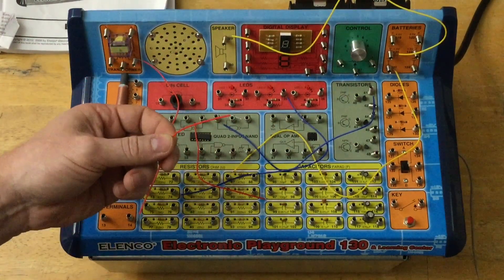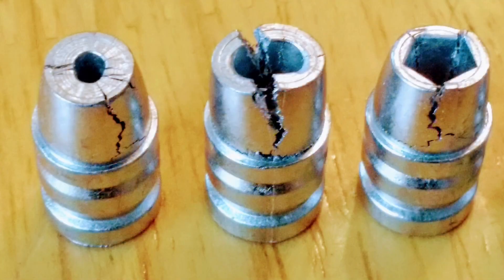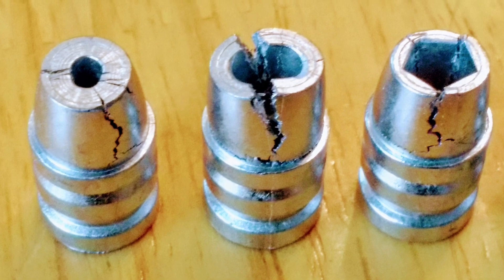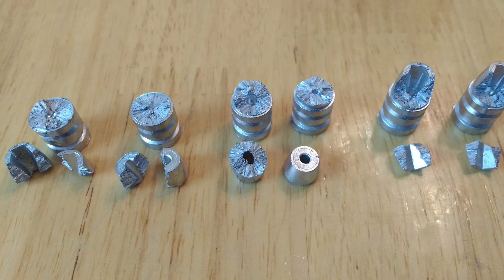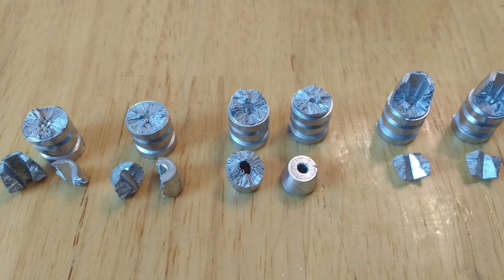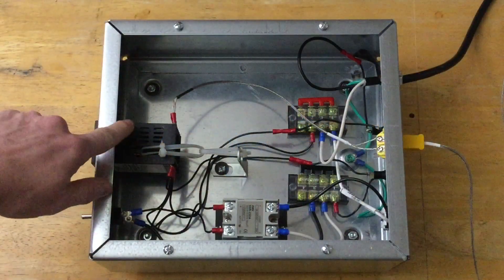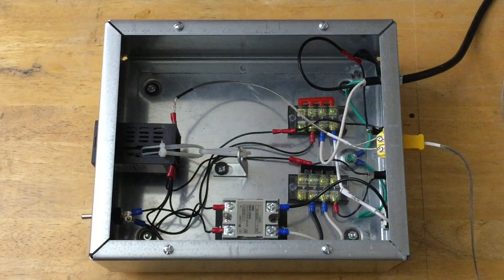On a more serious note, I owe a huge thanks to Dave over at Thorzak 777. He saw some issues I was having with the lead getting way too hot in my Lee 420 pot. In a previous video I let the pot run down further than I had ever done before and didn't realize just how hot that would let the lead get. The excessive heat started to cause several issues.